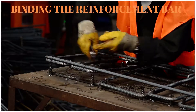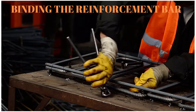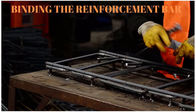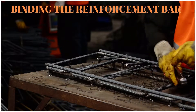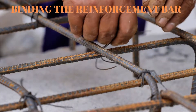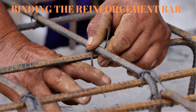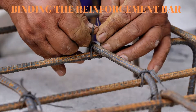Steel bars for RCC work — all finished steel bars for reinforced work should be neatly rolled to the dimensions and weights as specified. They should be sound, free from cracks, surface flaws, laminations, rough, jagged and imperfect edges, and other defects. They should be finished in a workmanlike manner.